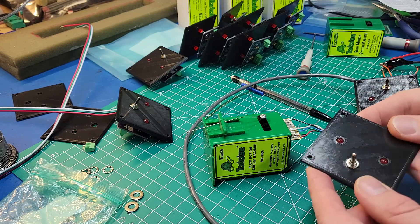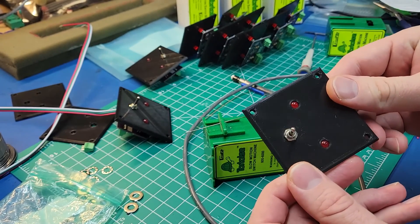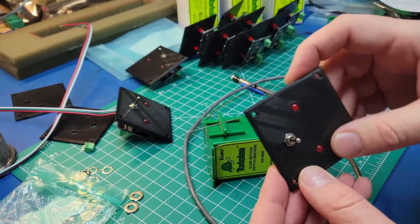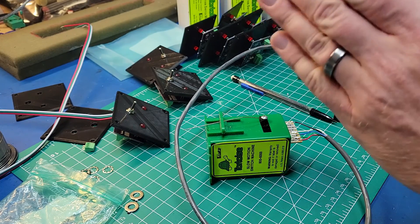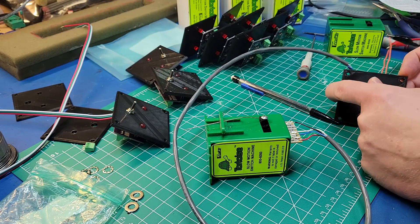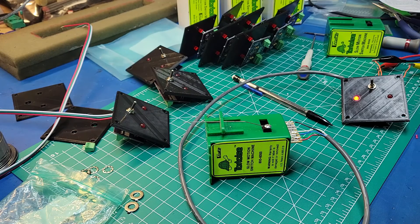The goal is I've got 14 switches on my layout that I need actual ways to control. I made these little boards basically to house the switch along with some LEDs, and I 3D printed some of these little bezels that will actually be on the front of the layout to control the switches. The goal is I'll have one of these per switch, kind of in line with each switch on the layout where they're located. It'll just be a manual control - I'll flip the switch to select which direction I want the switch thrown. No computer control, nothing fancy, just simple switches with a control panel that shows me the state of the switch.